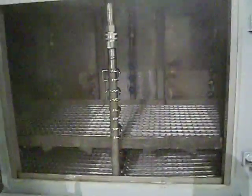You access the system with the handles, and this is where the washing occurs. The primary manifold is the oscillating manifold — that's this manifold that travels here all the way under the conveyor, back around, and up, and also across the top. There is a second set of manifolds back here that goes around, and another set that comes around on this side. At the beginning of the system where you see the black area, those are actually curtains, just like you saw on the outside — they are baffled inside the vestibule section.